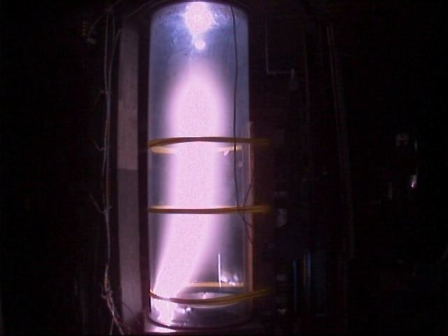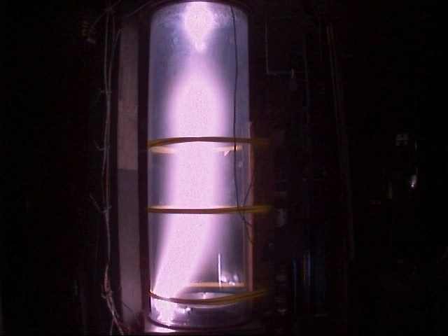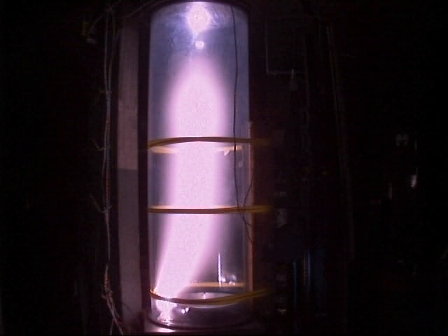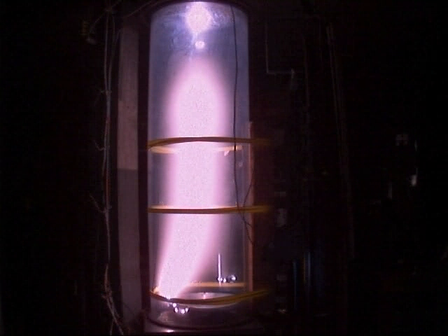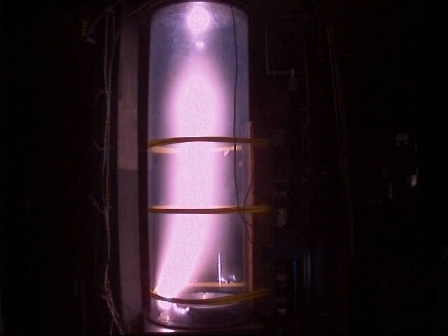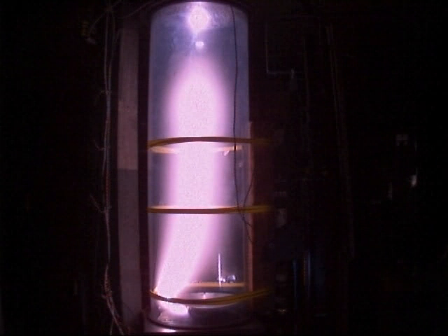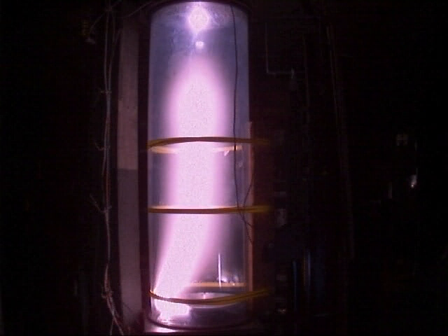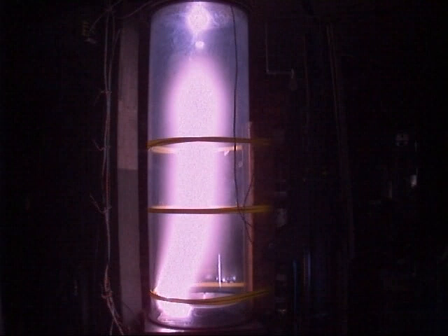I'm probably going to put my UV glasses on for this. The water at the top. UV glasses are on now. Four amps. Some migration of the balls on the screen and dish area. A little oscillation on them. The tube is reflecting this activity. Four amps, 120 millitorr. Fluttering activity again near the base. Turn up the power and the flutter goes away.